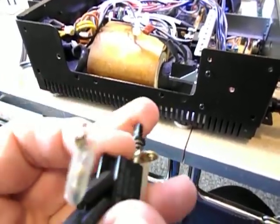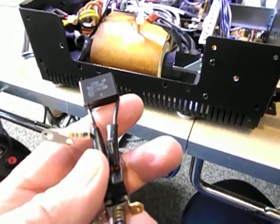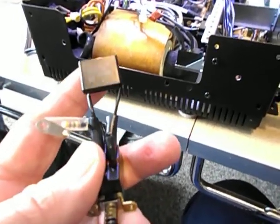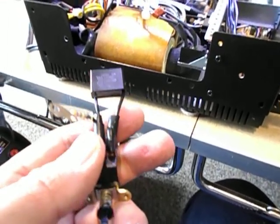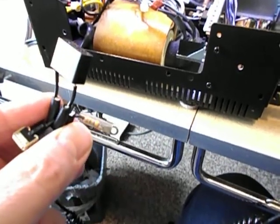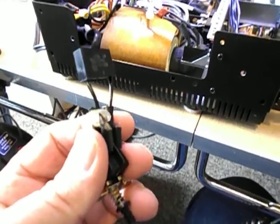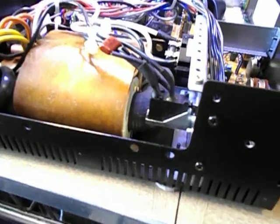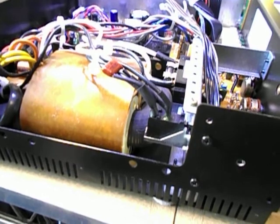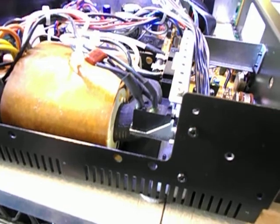The spring was still good on it. Another thing to check is this capacitor — it's a 0.01 microfarad, 600 volt. They're usually gone; it's taken so many hits over the years. This capacitor keeps the contacts from arcing and prevents any kind of a pop from the contacts. So here I installed a new TV3 Matsushita switch with a new mylar — polyester — capacitor, 600 volt, 0.01 microfarad.